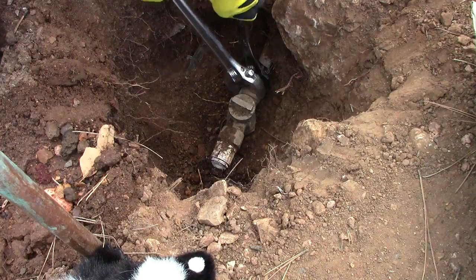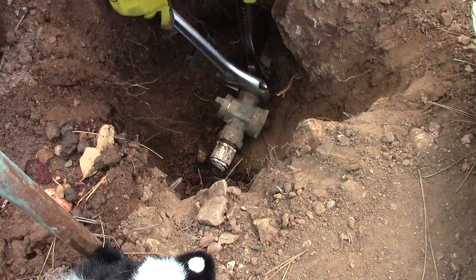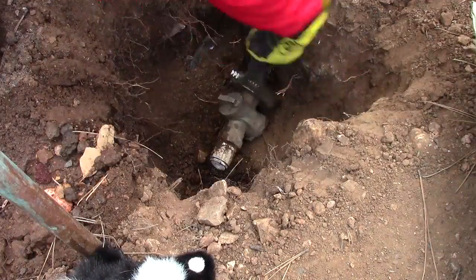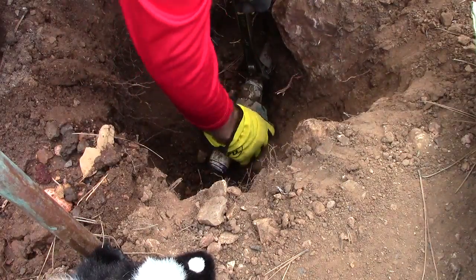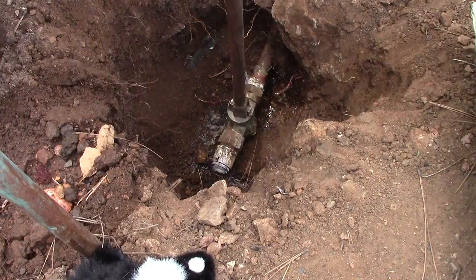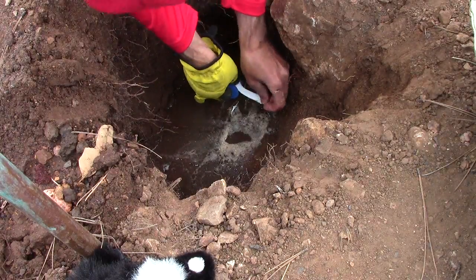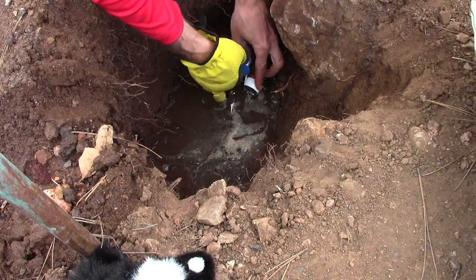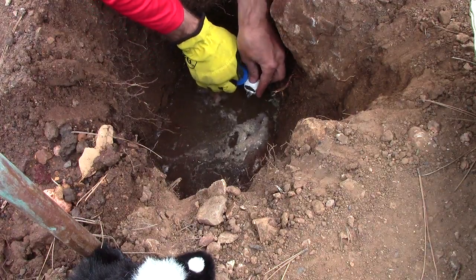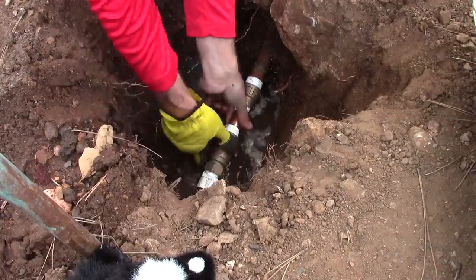This one's on there pretty tight — it's been on there for who knows, 10 or 15 years. I was trying to let the pressure bleed off but it was not going as fast as I wanted, so I just opened the key up to relieve that pressure so we could slip that right off. Then we want to clean the pipe real good with a wire brush and put on our Teflon tape like our other fittings. I did put on some pipe sealant in the coupler on the threads, so it does have sealant and Teflon tape.